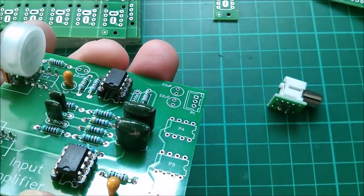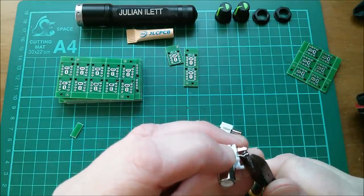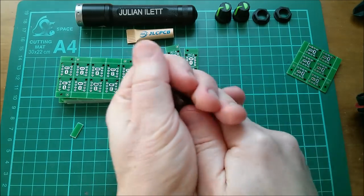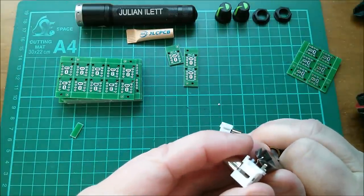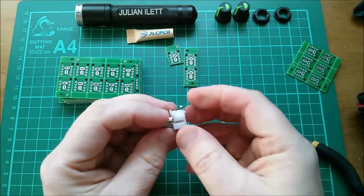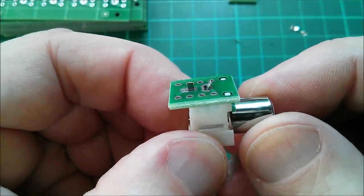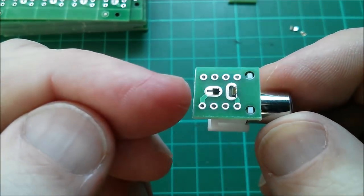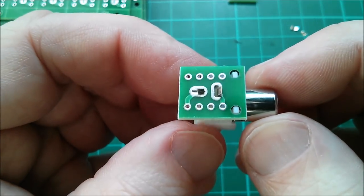I'm just wondering whether to pre-cut bits of these pins off before I solder it, because these are probably steel, and if I start trying to cut these after I've soldered it, it could fracture the solder. Or I have to stack that fairly high off the board and leave those pins in place. I'll try cutting them. That means I'm going to lose that barb on the rear pin and lose part of this little bent springy thing. Let's try cutting that - oh yeah, that has cut actually, that's not too bad. That's lower profile - I've still got this pin with its bent-over bit to hold the socket in the board, and my square pegs fit pretty well in my round holes.